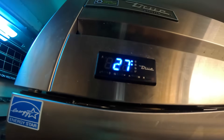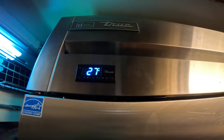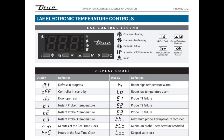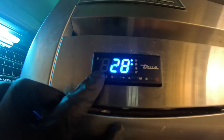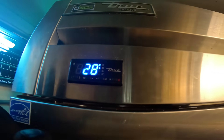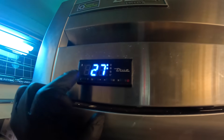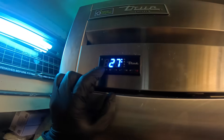It's at 27 degrees right now. Let's give this thing a chance and see what happens — hopefully we don't have to get into any settings. To check the set point, there are four buttons here. You pretty much hold this one down and that shows the set point: negative four. Release it — that's fine. This thing was locked, so to unlock it, let's see what I did.